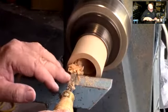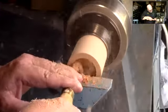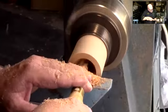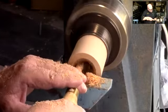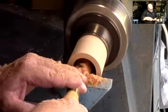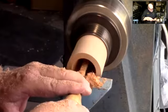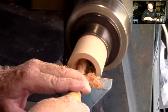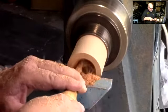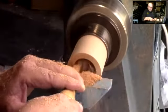When the cut starts to get too much, I'm going to push over to center and then step down in. I ground this scraper out of just a half inch square nose, but I also have them in larger blanks. I've got one that's three quarter inches wide, three eighths of an inch thick, and that one is commercially available and is ground like this.